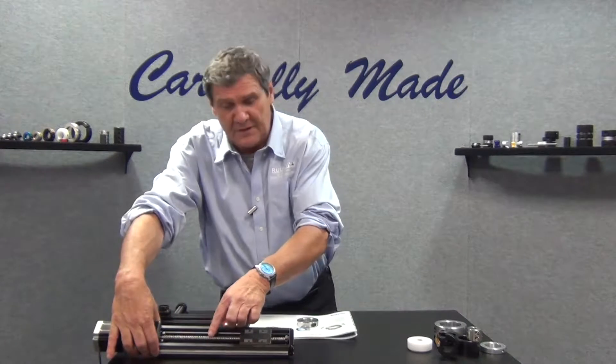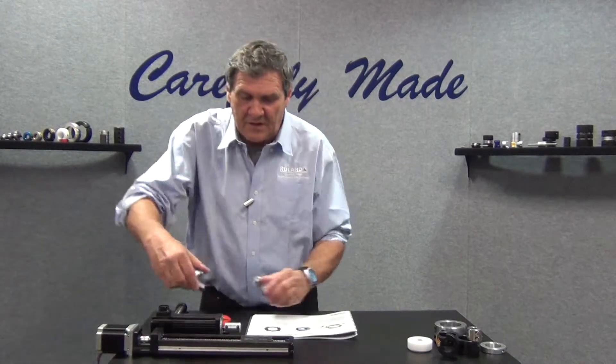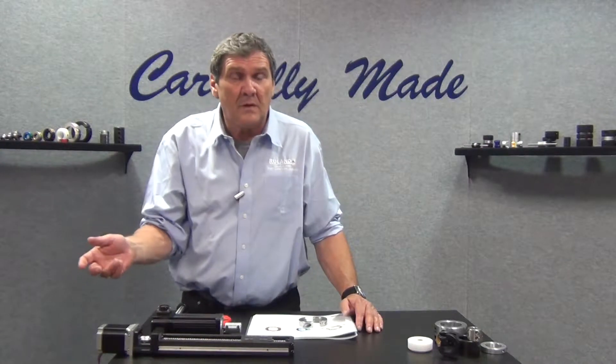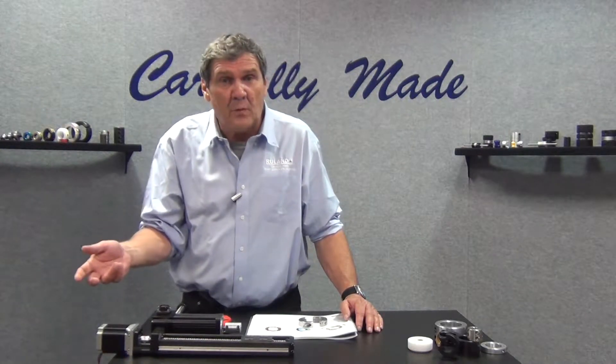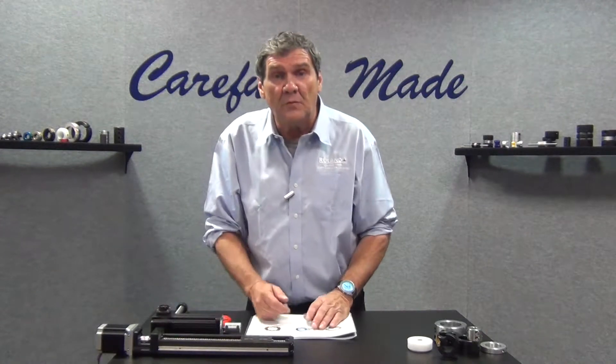if we wanted to put a collar here on this actuator, with a two-piece design we can come around and put that collar in without having to disassemble like you would for a set screw type or for a one-piece clamp type. So service and remove in place.